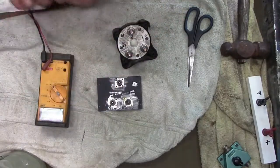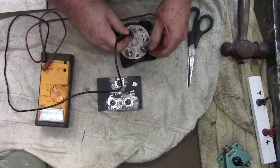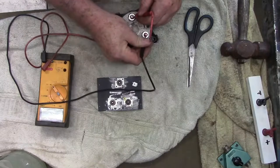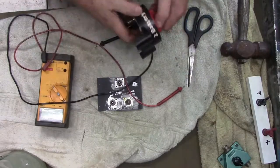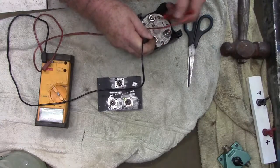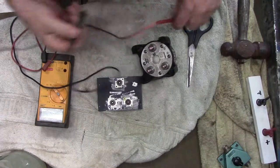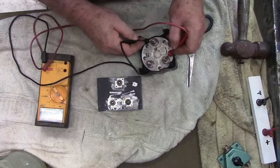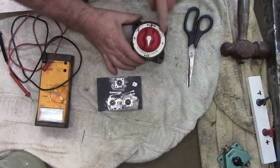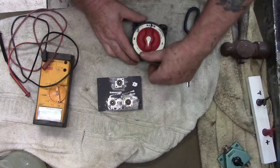What I do want to check is — good, no good, good, no good — perfect. Off should turn both off, which is the only concern with the 'off' and the 'both' positions. Because this was made for a battery, 'both' meaning both antennas, which is not going to be a good idea. But at that point it's working — I just got to remember to get rid of the 'off' and 'both' and just have 'one' and 'two'.